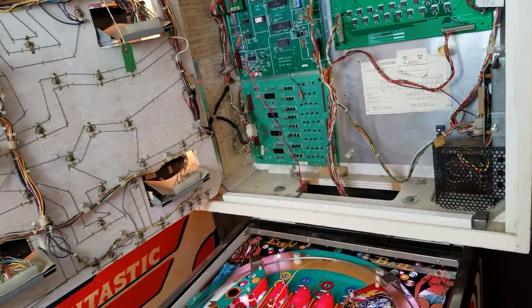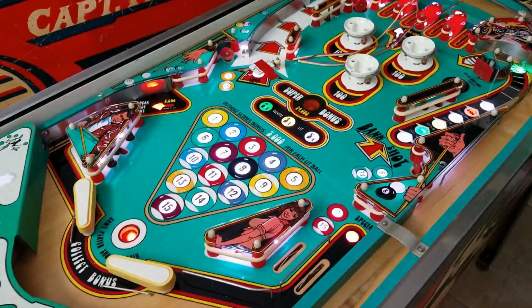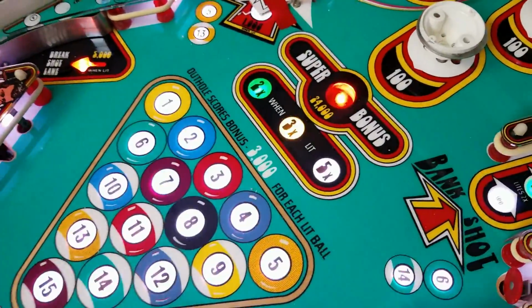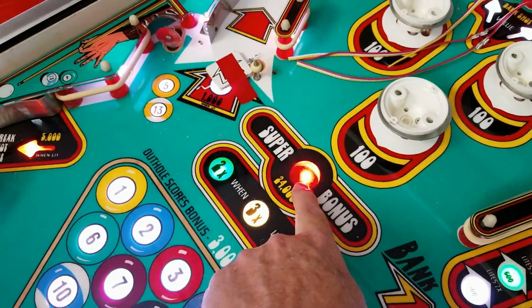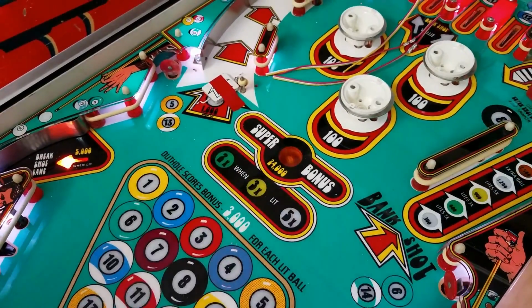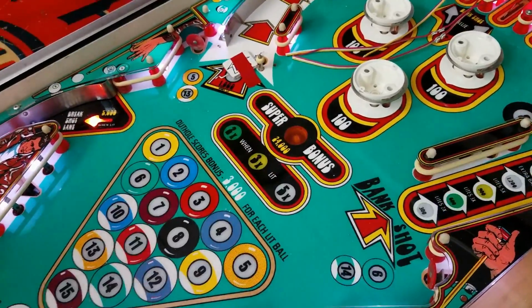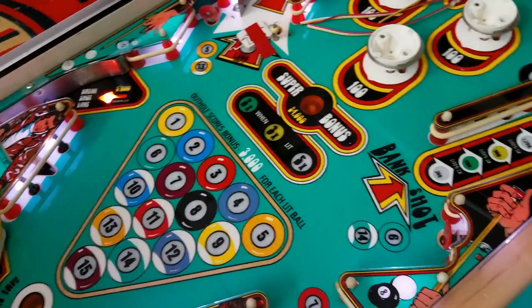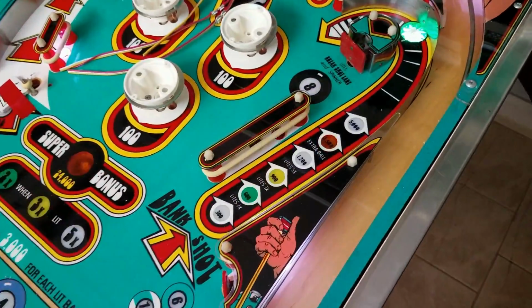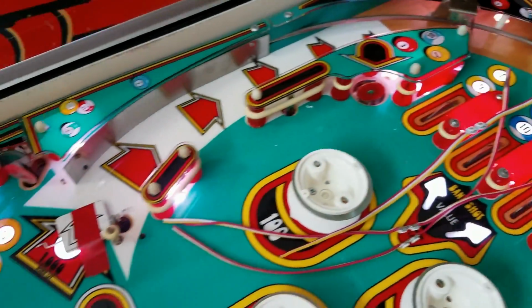And flashing lights. It's amazing what a little bit of power does. Now, if you look at these lights, they're all flashing on and off with the test mode, but this one seems to be flashing at its own rate, and that's because the code actually flashes that LED itself. So we have two sources flashing the LED now, and that's why it looks a little different from the other ones. But everything else looks like it's on and working correctly.